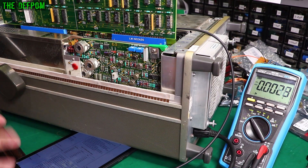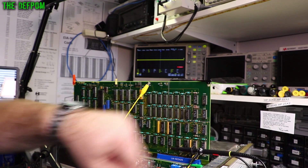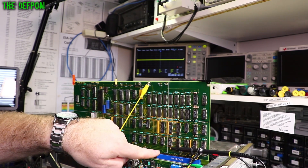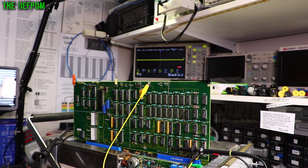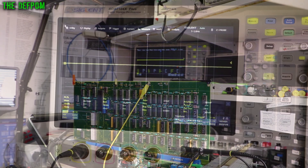I think that beeper is supposed to be going off because all the front panel is flashing — it's called the BLT, blinking light test — so I think it is supposed to be doing that, as irritating as it is. Pin 3 of U707 was only 4 volts. The 4 volt ones I'm a little bit concerned about; 4.5 less so. I would have thought 4 volts would be a bit strange. I wonder if there's a waveform there that might explain it. The next stage is to clip TP704 to ground and probe on TP700 to check for a certain waveform.